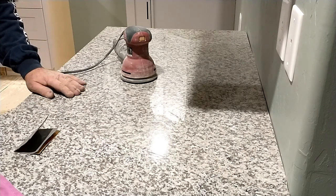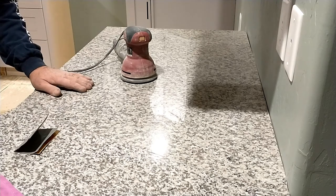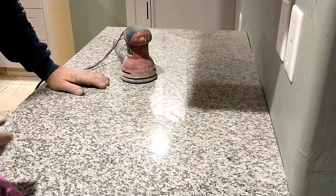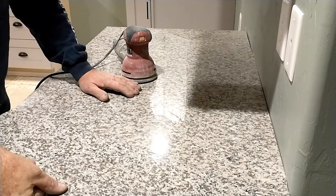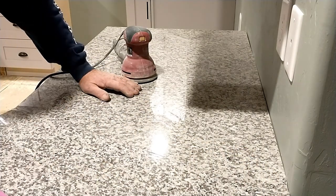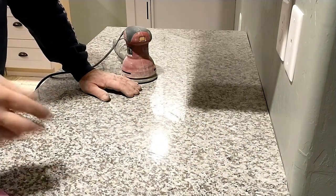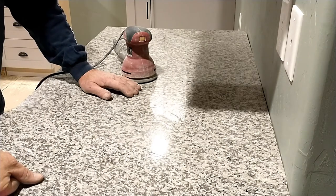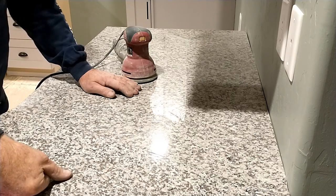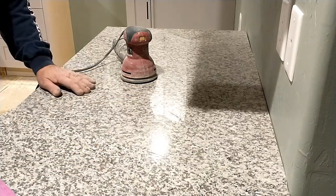And just plan ahead, have your method all dialed in, because the epoxy does not wait for anybody. If you fail, I did one joint experimenting and I did not like it. It was too dark. It just turned out to be a stripe. So I took a utility knife like this and I dragged it back out a little bit and made some new mix of epoxy and just troweled it into the crack again, let it set, and was able to change the color of it and make it fit my situation more.